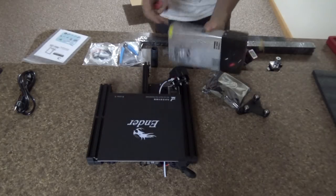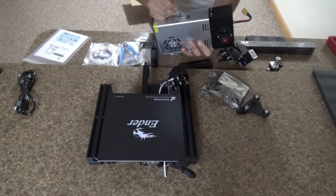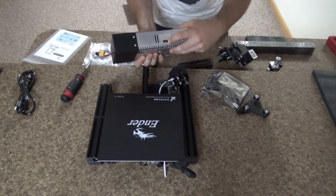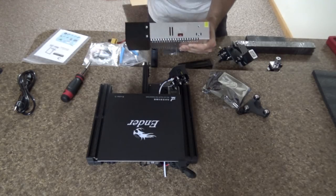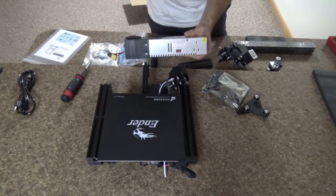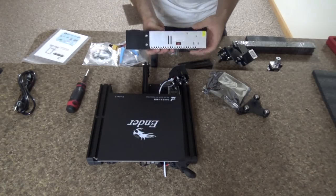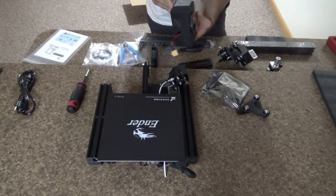Okay, so first thing I'm going to do is flip the power supply over to 110. People were questioning on the Facebook group the fact that it says 110 here and then on the actual power supply it says 115. It really doesn't matter because of the way the power supplies work, it just switches a transformer and then rectifies it and electronically converts it to 24 volts. The Ender 3 uses 24 volts,